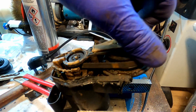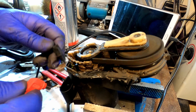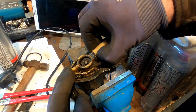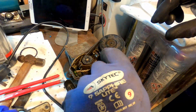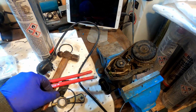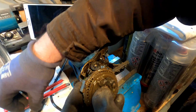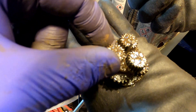If we change the polarity it'll retract. But it looks like there's a lot of water in there, so water could have been in the motor. Although it's spinning freely now, I don't think it's got enough power to drive under load. Look at the amount of water in there - I'll take the belt off. The teeth on the belt and the teeth on the cogs look alright. That's a wee spline that drives a number of wee gears. There's all the gears. I wonder if there's probably lubrication in here.